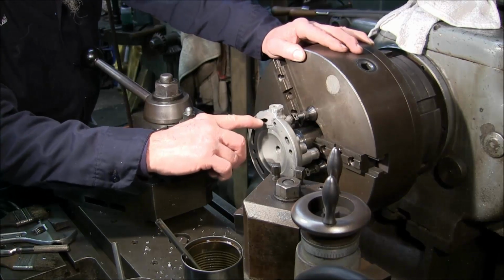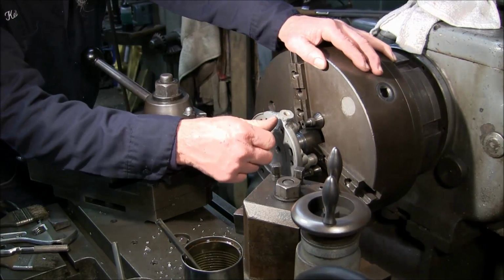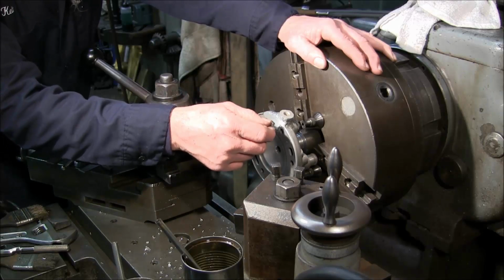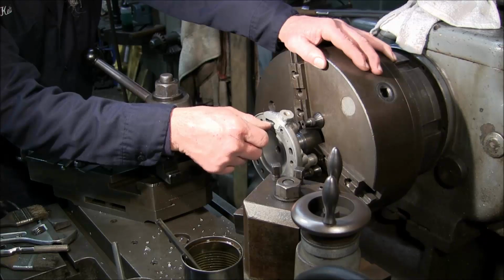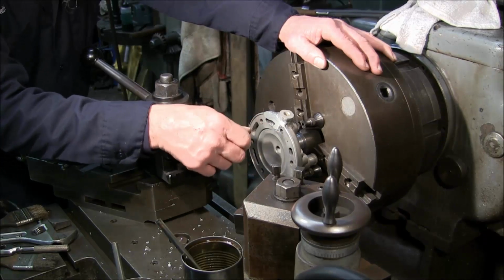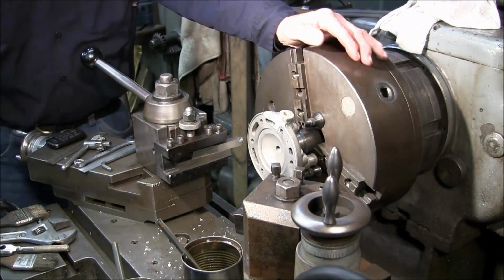And then we're going to go ahead and take the rotary burr and kind of work it a little bit and shape it before we get all the way down in there, so that we got some material on this outside to help protect it, so we can get close to the right shape and protect our finish. And our last skim is going to be cleaning up this whole thing so that we can have a mating gasket surface right there.